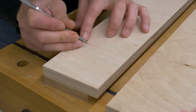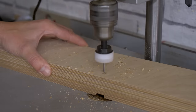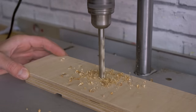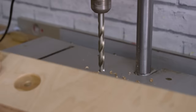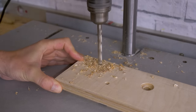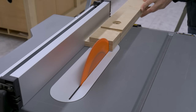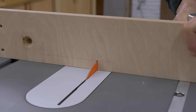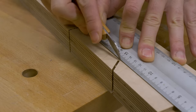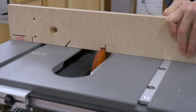I pre-marked the remaining cuts and holes following the plans. First I drill the holes and then I cut all the rebates so that I can attach the legs and close the folding legs. I'll finish emptying out the holes for the legs with a dado stack. First I'll make a cut with a knife to avoid tear-out when the blade cuts into the wood. I'll do this process in two runs.